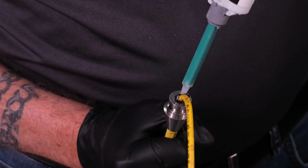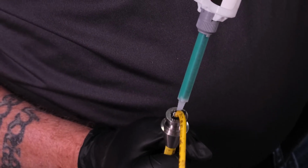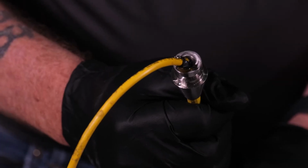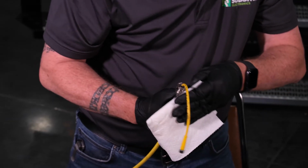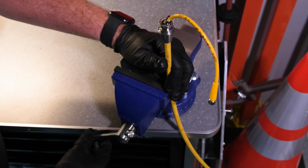Depending on which kit that you have, you should now assemble the included epoxy gun or ready your own epoxy applicator. Fill the inside of the base coupler with epoxy to encapsulate the pigtail and soldered connections. Avoid getting epoxy on the outside of the base coupler and thoroughly clean off any that spills out of the inside of the coupler or drips onto the outside surface.